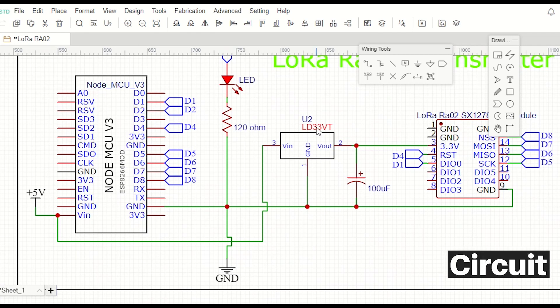In this video I am using the LoRa RA02 module in the 433 MHz to 515 MHz range, and I will use 433 MHz for communication. As LoRa is a transceiver chip, the circuit diagram for the transmitter and receiver section is the same. LoRa uses SPI communication to interface with the microcontroller. Here I am using NodeMCU ESP8266, but you can use any Arduino board with SPI capability. LoRa requires a 3.3V supply, so I am using a 3.3V voltage regulator to step down from 5V.